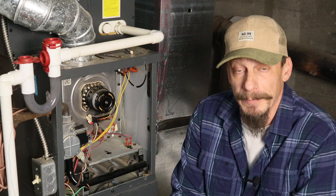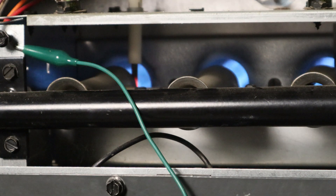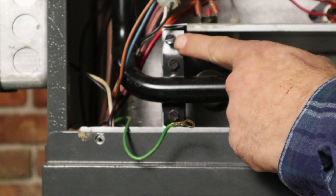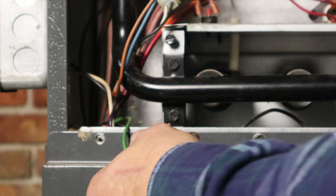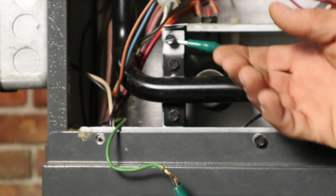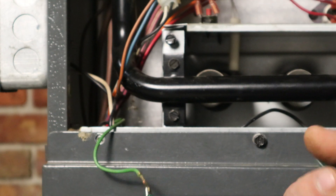These steps are just as easy as cleaning the flame sensor and can get the furnace back up and running again. Watch what happens when I remove this green alligator clip — same exact symptom, totally different problem. What I did there was disconnect this ground wire that was screwed down on a terminal connecting to the chassis of the burner. I simply used an alligator clip to connect to that same spot, so when I pulled it off, I disconnected the ground.